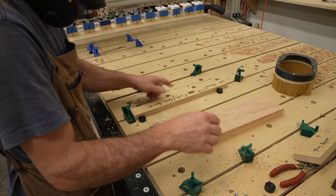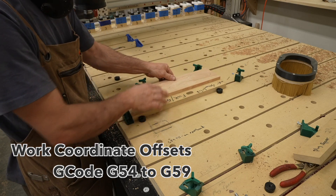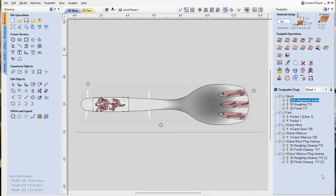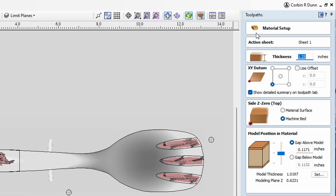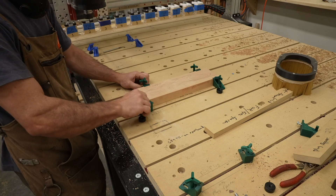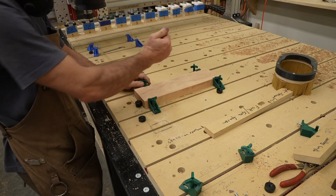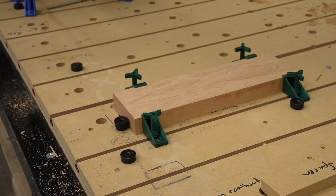I'm a big fan of using the T-track to hold down my work pieces, and on my CNC table I like to use offsets to do different operations at different locations. Vectric VCarve really doesn't have a great way to do offsets, so I kind of fake it. The way I fake an offset in Vectric VCarve is I go to the material setup, check the use offset option, and set the X and Y offset for the origin of the work piece to be the location on my table, so I can use this particular offset again and again to reproduce the same thing. I'm also a big fan of these 3D printed hold downs — they can be printed exactly 1.25 inches tall and hold down stock really well with just four of them. The great thing about those is if you hit them it's not a big deal because you can just print some more.